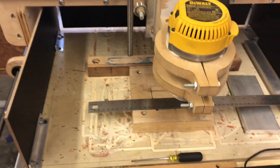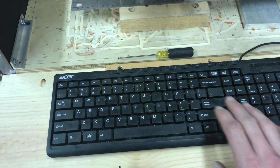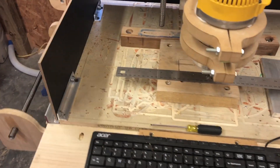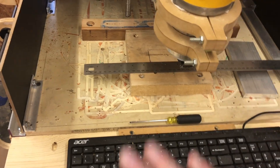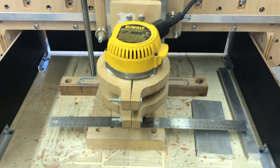I'm going to install two more of the new boards for the Y and the X axes, leaving the Z as it is. I might buy another DM542T for the Z later, but the Z doesn't move a lot on mine — it basically just goes down, stops, and holds position to route. I'm not doing a lot of 3D carvings, so I'm not too worried about the Z for now.